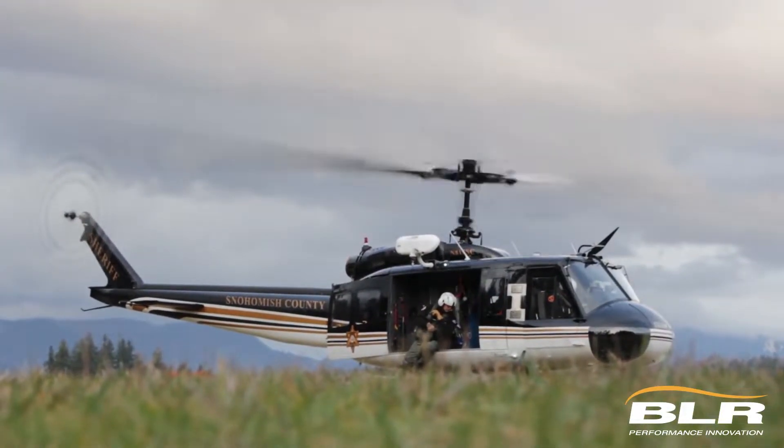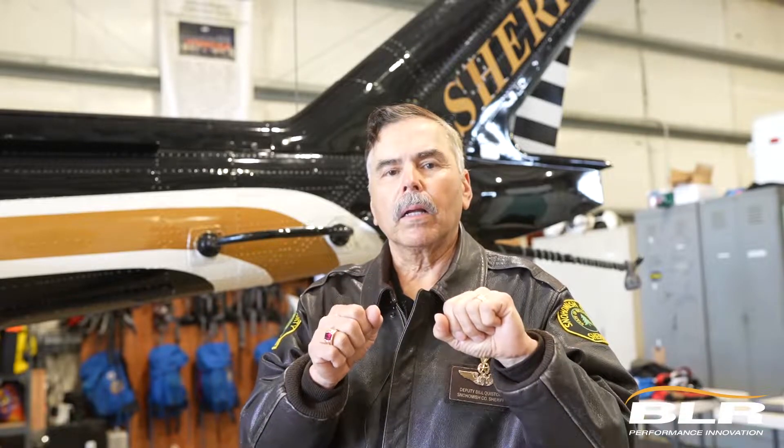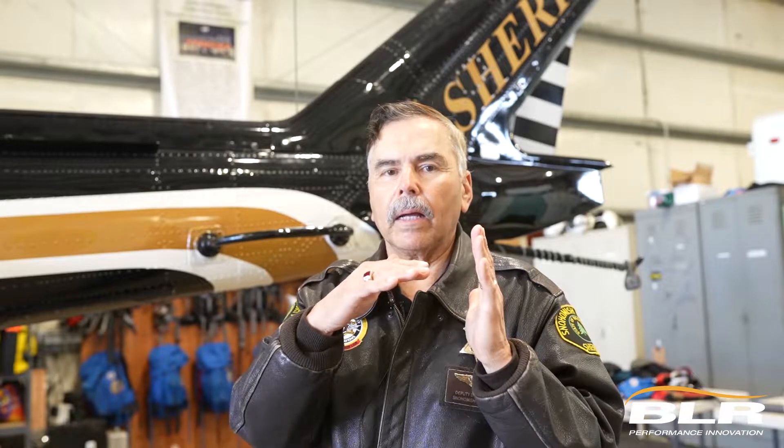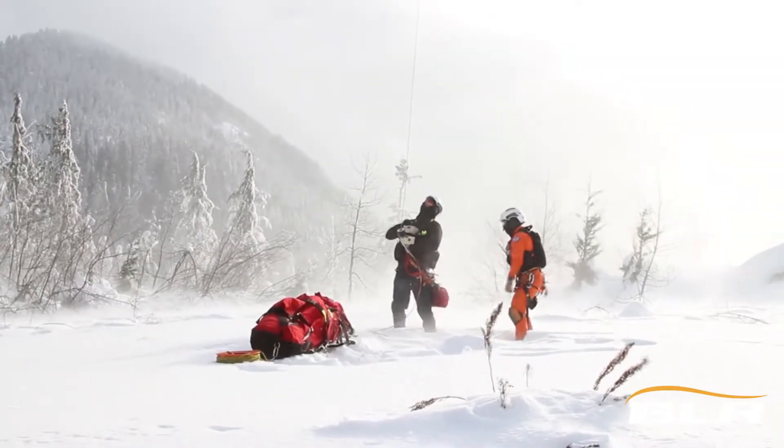I'll stand off away from the mountain at whatever altitude we're going to conduct the mission — six thousand or eight thousand feet — a safe distance. I'll come into an OGE hover and I'll see how much pedal is being demanded, how much pedal am I putting in, and how much pedal do I have left. If I judge that I don't have enough pedal left, if there's not enough left pedal remaining at that OGE check, then I'll descend and land down in the valley, offload some gear, burn a couple hundred pounds of fuel, come back up to altitude and check again. I need that safe pedal margin in order to safely come over the terrain and conduct rescue operations using a rescue hoist in an OGE hover.